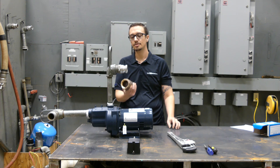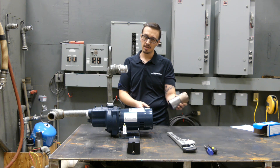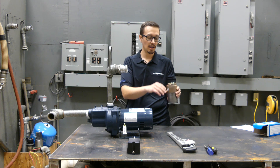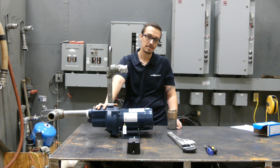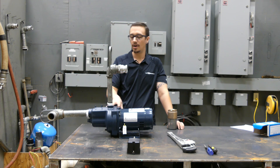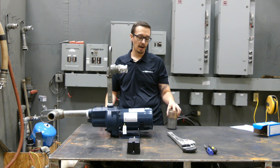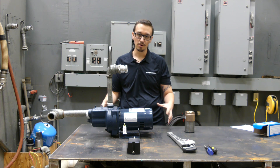First thing I'll mention: when you're installing a jet pump, a properly functioning foot valve is going to be extremely critical. The foot valve sits on the bottom of your suction line down in the water well, lake, or wherever you've got it installed. It allows water to enter but has a stopper that prevents water from flowing back out, keeping water inside the pump so that when it turns on it can get traction and move that water. Without a foot valve, the volute would be empty and the pump can't pump air — it would just run and potentially damage itself. Always use a good quality foot valve.